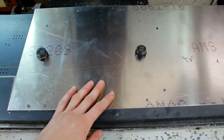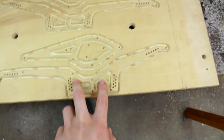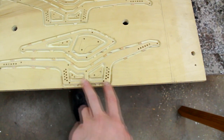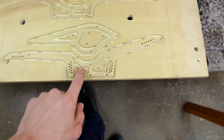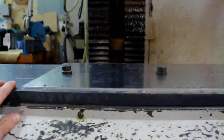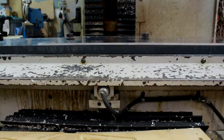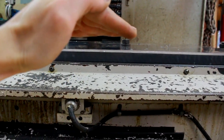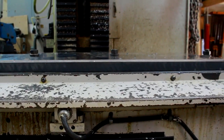Down here there will be these guys, so scrap screw hold downs. That's actually not gonna, well, it might help, because I might put screws in there as well, but I think it should be pretty good. Like I mentioned, the plastic was bowed this way, so when I bolt it down on either end, it squishes it flat, which is good, and the aluminum was also inverse like this, so it got squished flat as well. So I think this is gonna be pretty good. I got the drill bit in there. I'm ready for the first program, so wish me luck.